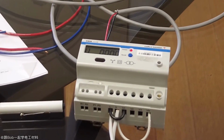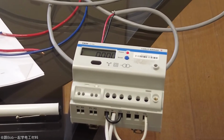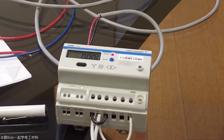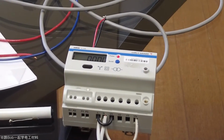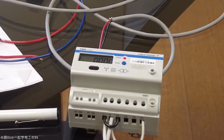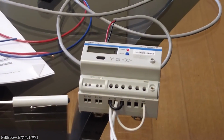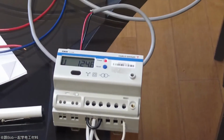The other option is if somebody already has their own LoRa network. If you look at a city, quite often what they do for water meters is they have all these water meters using LoRa. They put it in, it has wireless communication, and it goes to their system. We can do that with this meter as well. If you get into a situation like that, just contact us and we can help you do that. If you have any wireless applications, we can do something for that. And it doesn't matter which meter of ours you buy, they all will go into our UWP.